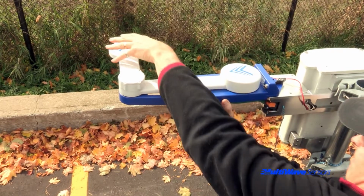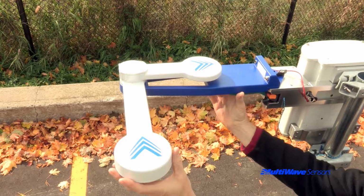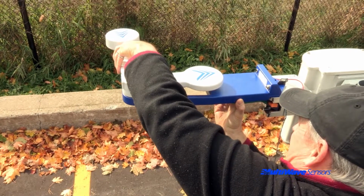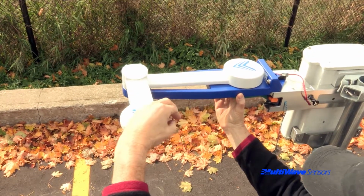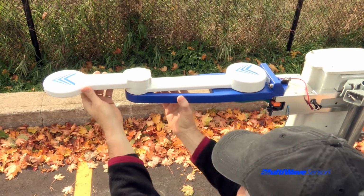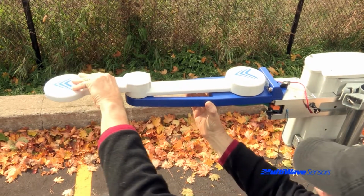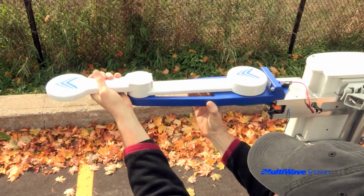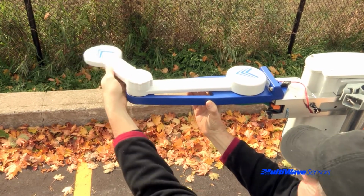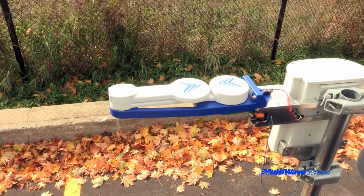It is important to note that each arm has a limited range of motion. The long arm can only move from the home position to either 90 degrees to the left or 90 degrees to the right. The short arm can move from the storage position to 90 degrees left, 180 degrees clockwise, 90 degrees right, and 180 degrees counterclockwise, but it cannot continue rotating around in a complete circle. The reason that the range of motion is controlled in this way is to prevent damage to the cables that connect each GPS antenna element to the electronics.